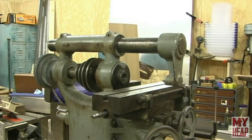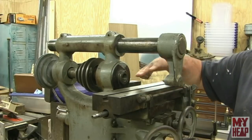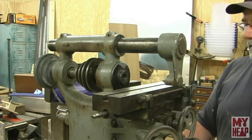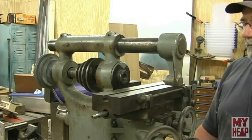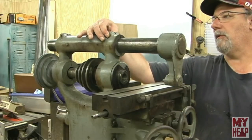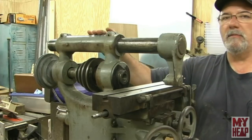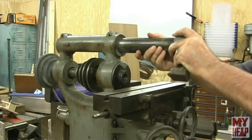The first thing I'm going to do is remove the overarm support. Some of you may have noticed that the table is really, really high — it's because the screw that raises and lowers the knee goes through the base, and I wanted it up where it would clear this bench top that I've got it sitting on. To remove the overarm, there should normally be two bolts here that just clamp the overarm in position. Mine are missing, so I would assume you just take those out and then this comes out.